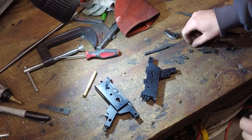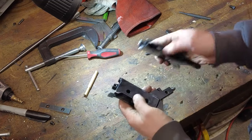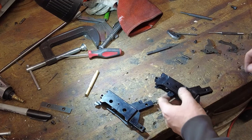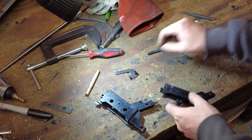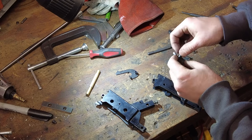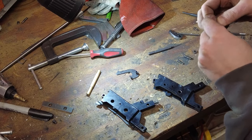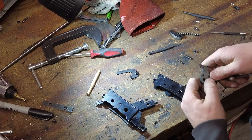While that is cooling off, the elbow's welded really hot, let's transfer this trigger pack over. So you can't use the original trigger pack because of the way they did their design. And it's pretty awesome, actually. There's no way that you can install this full auto trip right here. So chuck that. And then where that goes, they send a little bushing, which is in the side of the trigger, right there. Easier said than done, right? Okay. Yeah, that goes in the side of the trigger there.